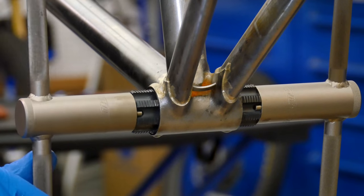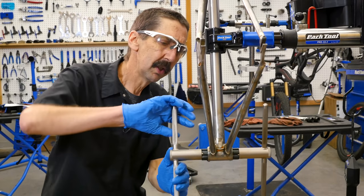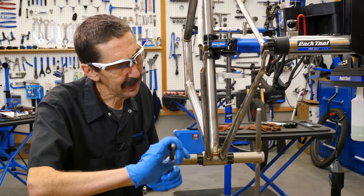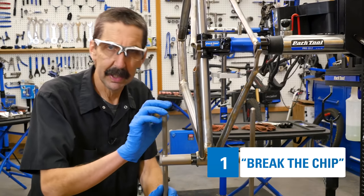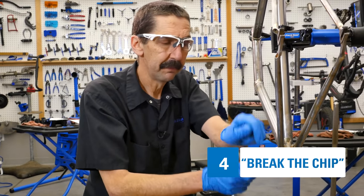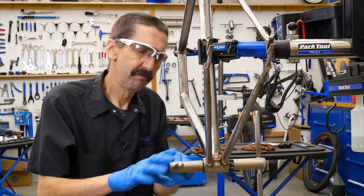So here we're starting to pick up a little resistance. A little more CF1 for good luck. On steel, it's a good tradition and a good habit — when you hit resistance, advance back up a bit and you break the chip. You can actually sometimes hear a little tick. So it's building up an edge in the steel inside. This is starting to get resistance here, so I'm going to back up, break the chip, and then continue. Advance, break the chip. Couple of steps forward, half a step back.